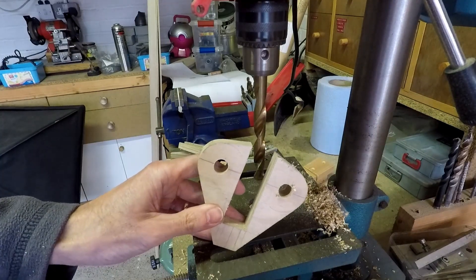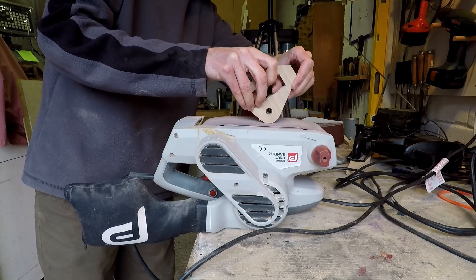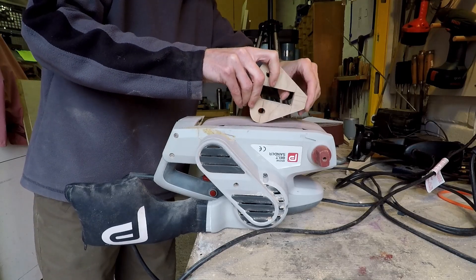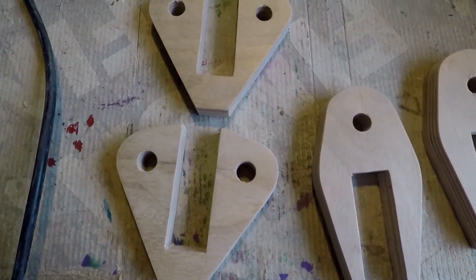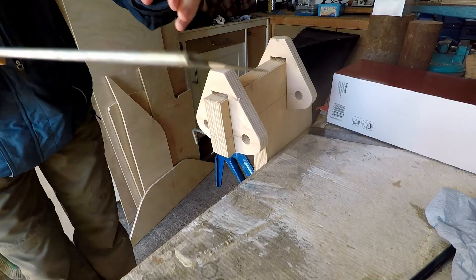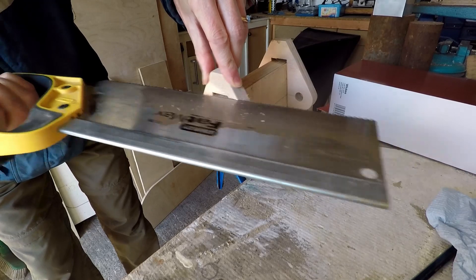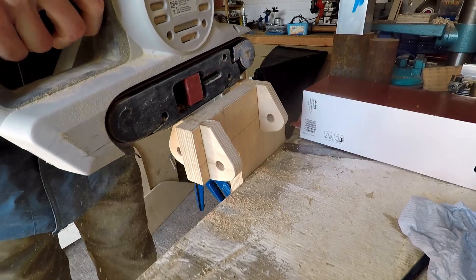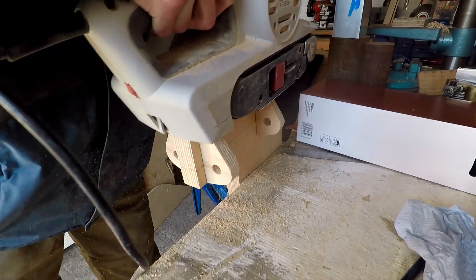So that's what the bottom mounting bracket looks like. I've now improvised a sanding table using my trusty belt sander just to try and get a reasonably smooth finish on these pieces. And this is what the pivot mounting points look like. I've now glued them onto the body using Bostick exterior grade wood glue and I'm now cutting away the surplus bits of the lower mounting points using a tenon saw. These are currently just glued on but I'm going to be running a jubilee clip around them to strap them into place more securely because I don't trust the glue.